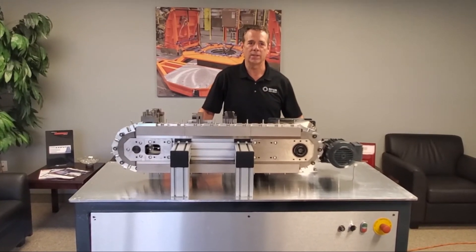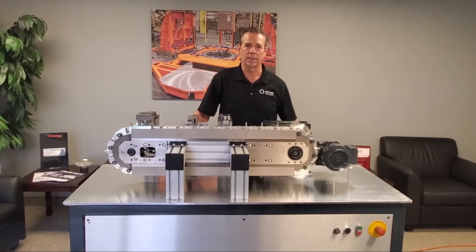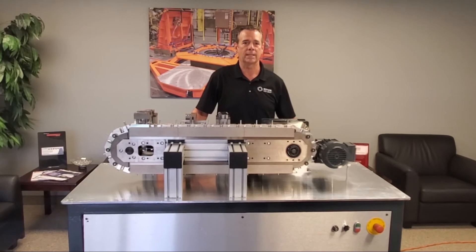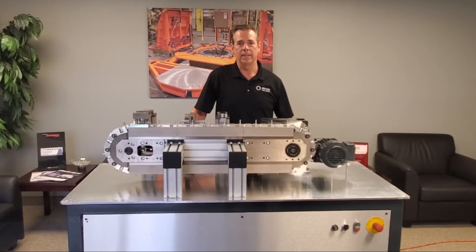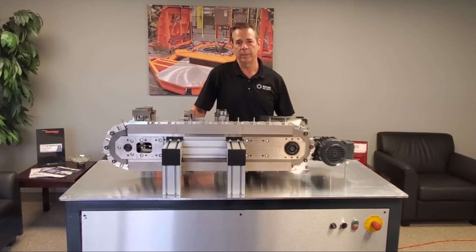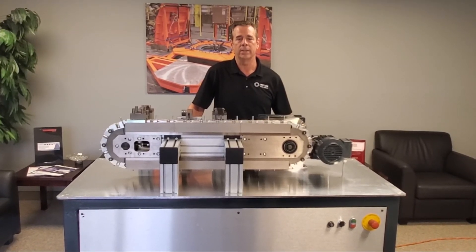The link chain is driven by a hardened cam wheel, which is driven by our standard fixed cam indexers. The conveyor can also be driven by our programmable indexer packages to give non-standard index distances per link size. The take-up end is a hardened cam that guides the link chain. The cam is preloaded and has take-up adjustments to ensure there is no backlash in the link chain.